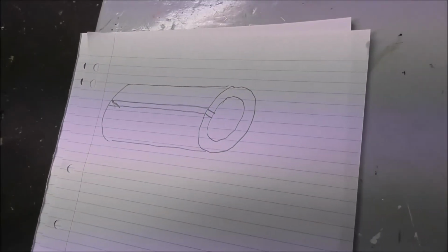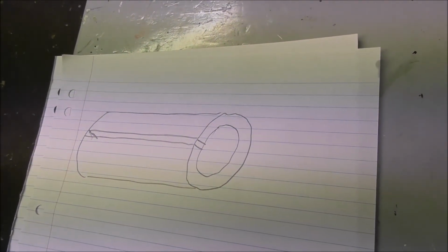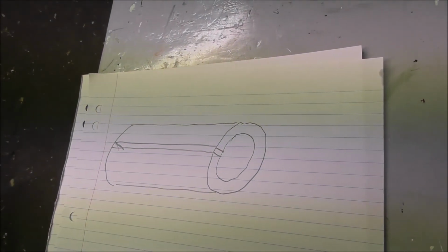For example, you could machine up a heavy metal sleeve that was split, put that in the chuck, and then bore the ID until it's a close fit. So then when you bore it, you generate extreme accuracy both radially and axially. Then you could slip the ball screw into that machined bore and tighten it up with the chuck, and you would get very good accuracy then within tenths of a thou.